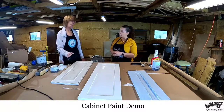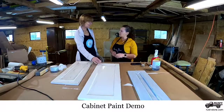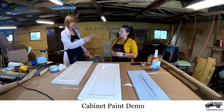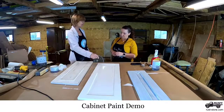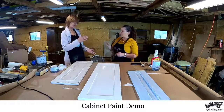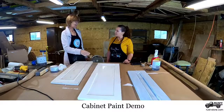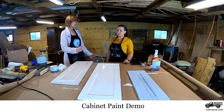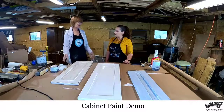And you'll never know. Or if it's not heavily distressed, like this, and it got chipped, you take a little bit of fine sandpaper, rough it up, get out the can of paint you painted it with and a small brush, and touch up the area. It might take 2 coats, depending on how deep the nick is. Once that's dry, sand it with real fine grit sandpaper, and then wax it. After it cures, it should all blend in. You can't tell, and you repaired your cabinet.